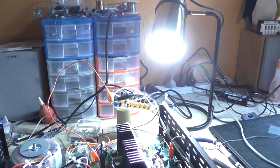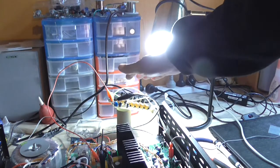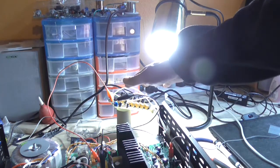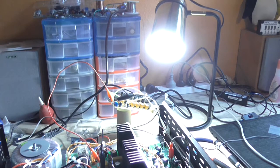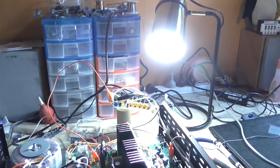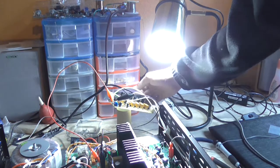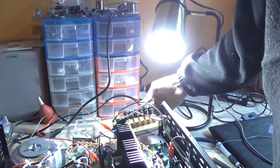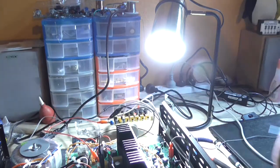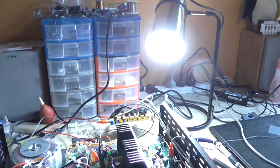That means now that I've sorted out my issue, and this input selector will run fine on 20 volt DC, and there's no noise or anything that's concerning, I can still use this board, and now I can go ahead and do my back panel. And hopefully everything goes right. I've already pre-measured the distances that I need for holes and stuff, so now I've just got to do that task. And that board should still fit in the case just nicely. In fact, as I'm looking at it, I've got a good probably 5mm from the heatsink. So now that I know what I'm doing and where I'm going, I can move on.